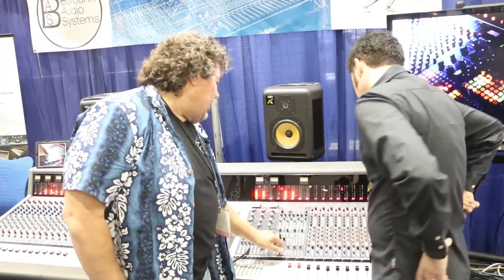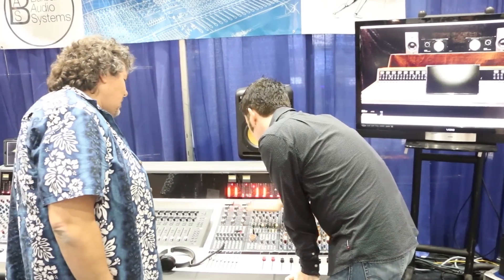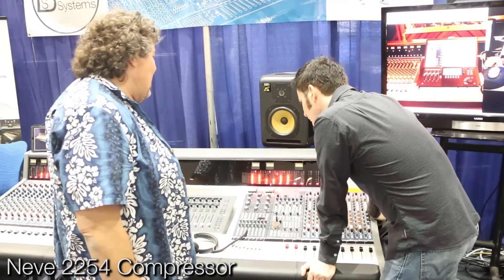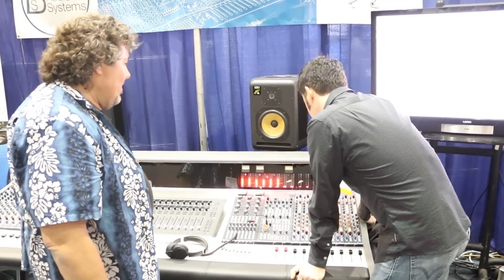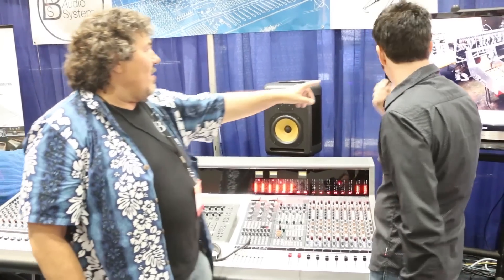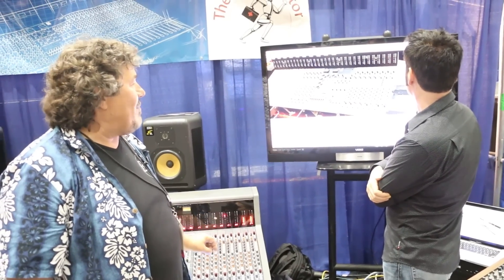For the 2254 compressors — original diode compressors — you can switch them straight into the mix path, or if they're not there they're available on the connector panel or patch bay. We're more than happy to build a patch bay; some of the consoles we build have one built in. This console shown here was actually being built with a full patch bay — this is a very early build stage, but you'll see it finished with the patch bay in a couple of pictures.